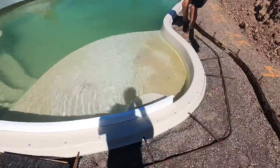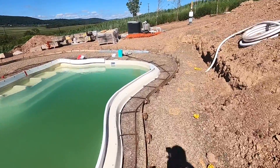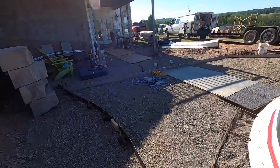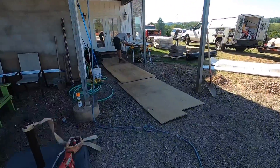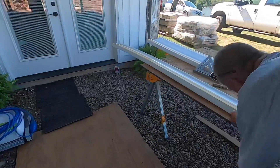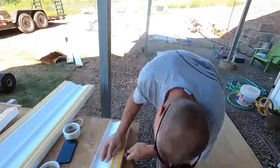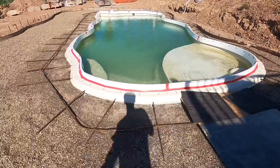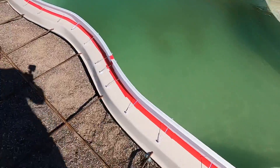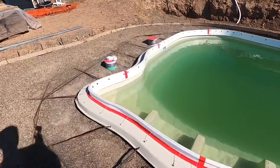They're a one-time use. Over by the filter box there's a notch around it because you don't have any space there. We marked it, then went over to the saw horses and sliced it — making a cut where we marked it. He's cutting it with a razor knife. Notched out where the box is, slice them out, and it sticks right over that thing. When it's done, all your joints are wired in, everything looking clean, cut around that filter box.